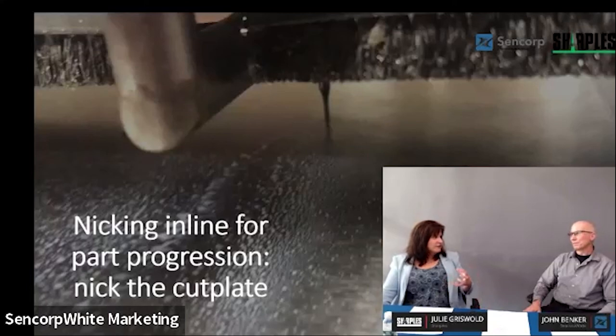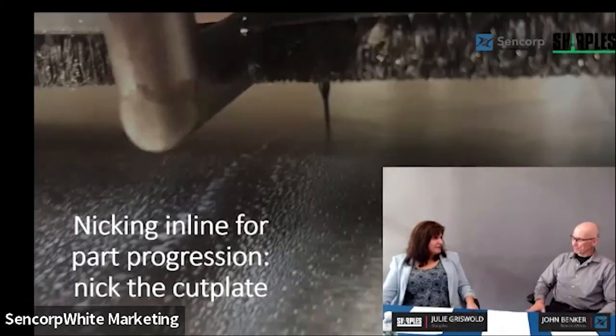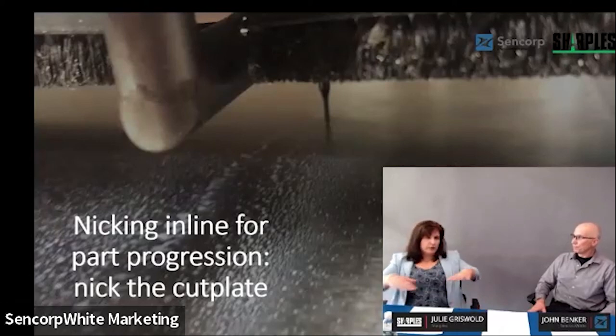The one thing that's critical with our industry is it's evolving to robotics. Repeatability is key—now automation means you have your time for a re-roll and you've got extra cavities that John recommends. Operators come in with pre-nicked cavities and you're getting the same results from the trim. Generally we say they should have a lower pusher and a plate to support the web. It's so easy to snap that web and then you're done. You can use a plate or even wood to support the web to help push it through, plus some simple male pushers to help support the part so when the suction cup comes down it's actually onto the part.